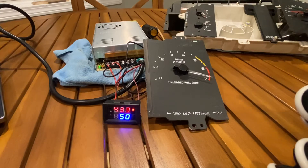This is where you need to make decisions about where you want the most accuracy. I actually did a plot in Excel where I measured every point in 500 RPM increments, plotted desired RPM versus actual, and made adjustments until I got that line as close to center as I could. It took a while — plan to set something up and have a nice drink or a snack, because you're going to go back and forth quite a bit.